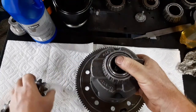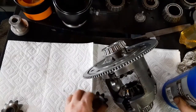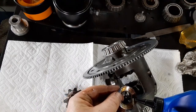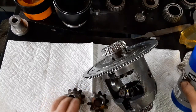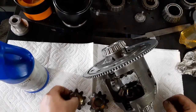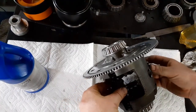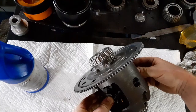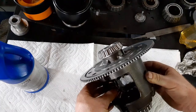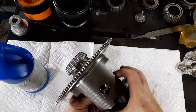Alright, that guy's in. We'll add a little bit of gear oil to the underneath of this wear plate, kind of spread it around, same with this guy. Slide these in, rotate it around, take a look down through the hole, make sure everything is lined up.